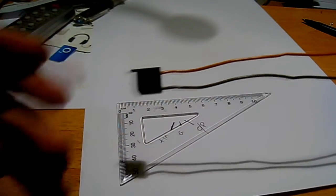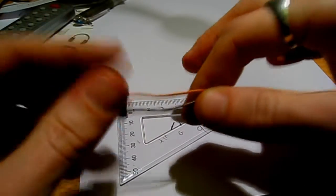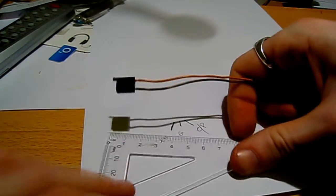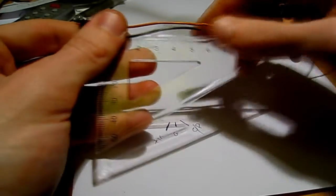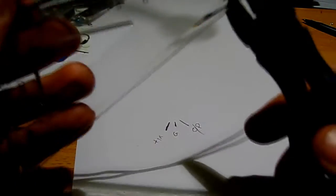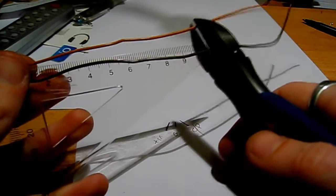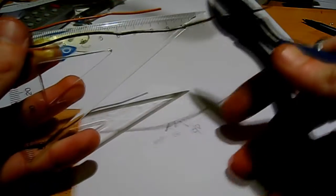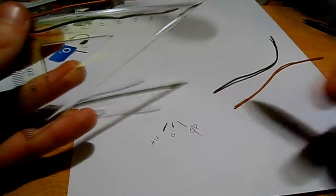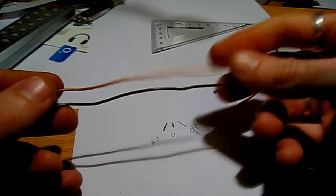Take the plug which you got off of your turntable, the one that went to the plug for the light, and measure from the plug — this doesn't have to be terribly accurate, you don't have to be spot on — but about 90mm. Measure it about 90mm and then chop it off, because the regulator is going to be mounted right near that socket so you don't need these things to be that long.